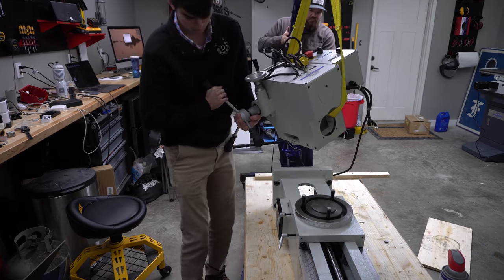Let's move on to the 96 holes that will be drilled with the 6.5 millimeter spiral drill. This time we will use the automatic tool setter. After the touchpad registers the drill bit, Pro Basic can then compensate for the height of the tool in relationship to the aluminum block to make sure that we have the perfect starting height.